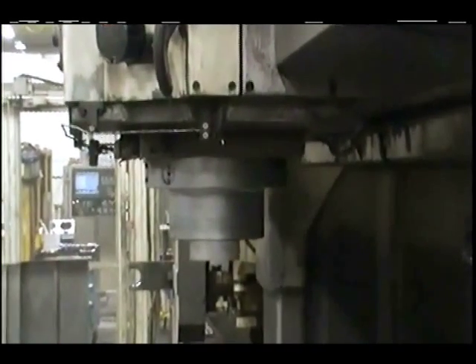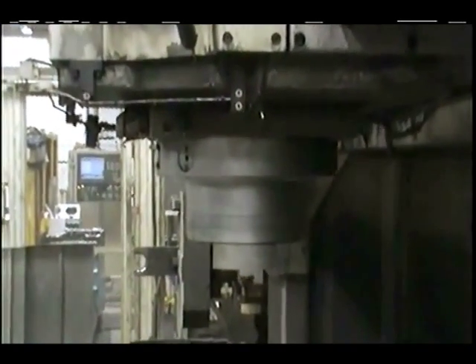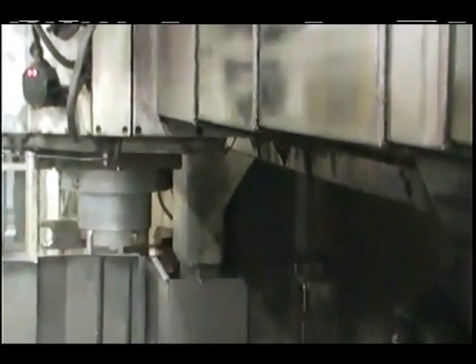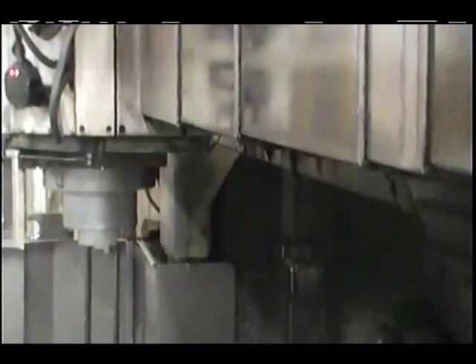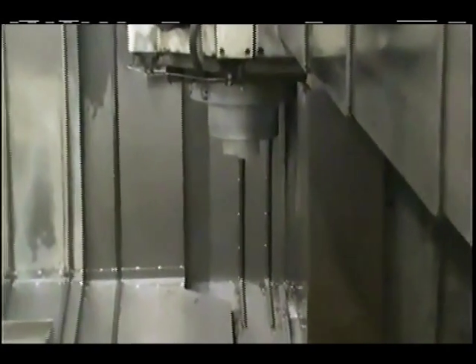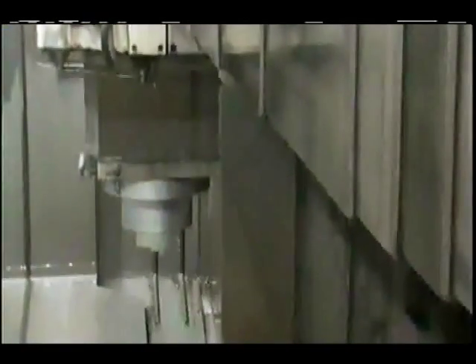This is the Y axis stroke. This is the W axis coming down to its full travel. The W axis rail movement of 51.3 inches, in combination with the Z axis ram travel of 31.5 inches, allows the ram face to reach the top of the tower.